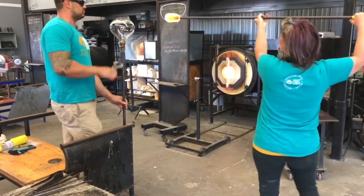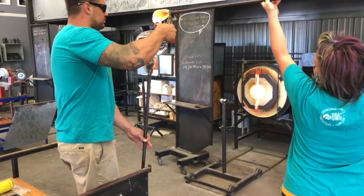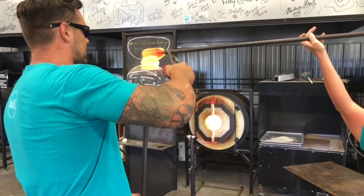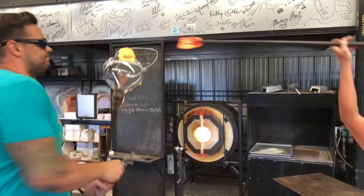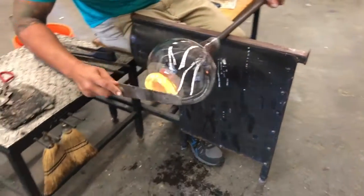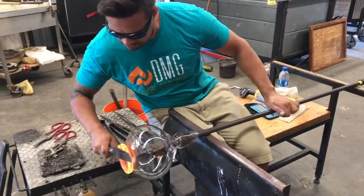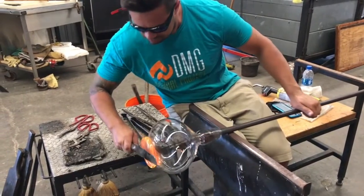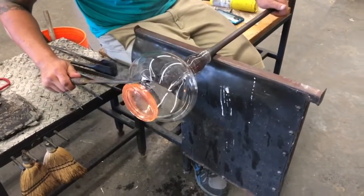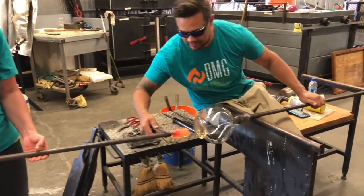Here we're going to put a foot on the bottom of this bowl, and we're going to use gravity to let this molten glass drip onto the bottom to create this foot. The glass we're dripping on is about 2000 degrees and the bowl itself is probably about 1200 degrees. You can see the temperature change in the color — the hotter the glass, the more orange or whitish it is. The cooler the glass, you can see the true color, so we see that the bowl shape is clear. The foot we just put on the bowl is the hottest part, and it is molten. Now you can see that it's kind of frozen up or become a solid.